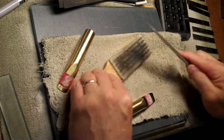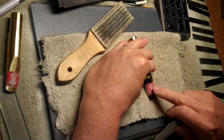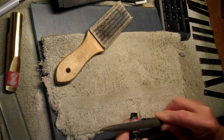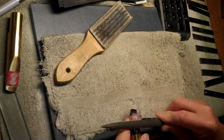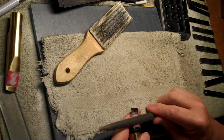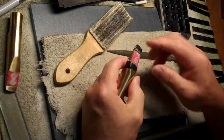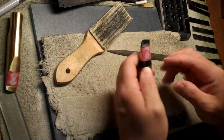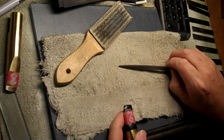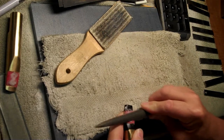I have a file card to clean the file off. I'm shaping — it feels like there's a high spot. A lot of guys who make mouthpieces just do all this on a belt sander. I can't dial it in with as much precision as I want doing that, and sometimes I take too much metal off. I think if I had a blank that had a lot of metal in the tip, that would be a better way to do it more safely.